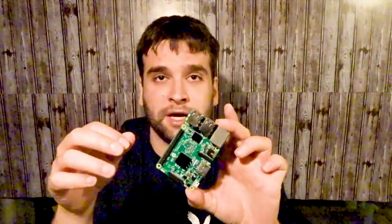Around the time I was getting the LM2596 and having all these issues, I was already starting to look at the Jetson Nano for Wolfie. The orientation I have my Jetson Nano running, its peak amperage is 4 amps — that is a lot higher than the Raspberry Pi. This buck converter taught me that I needed to level up the whole circuitry and plans of Wolfie for him to be reliable.